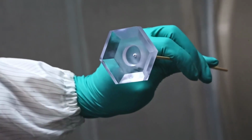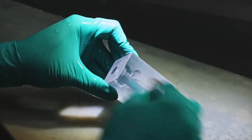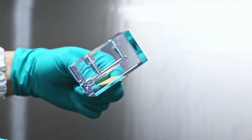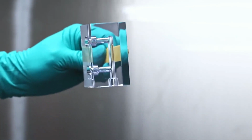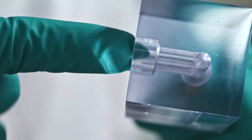To get the most out of the process, the workpiece should normally be hand sanded or machine polished to remove any major surface roughness or irregularities. One of the great advantages of vapor polishing is that it can reach down into areas that human fingers cannot, so even recessed features can be vapor polished and their surfaces greatly improved.